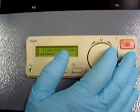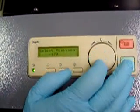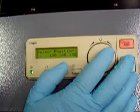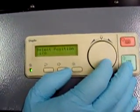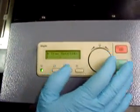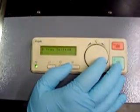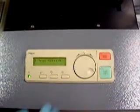A-tray position, that's where it reads it based upon the front of the tail versus the end. All the way from 120 millimeters from the start to 170 millimeters from the start. I typically leave them around 150. That's for reading the doubles detect.